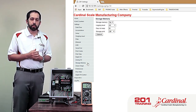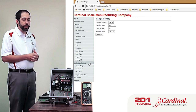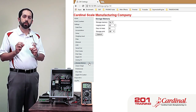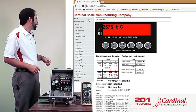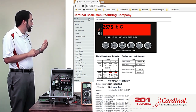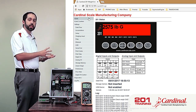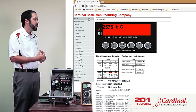The 201 actually has the ability to maintain a log of errors, event count, and event capture. If a micro SD card is installed inside the 201, it will keep a file log of events — like somebody pressed the zero key. That log is also viewable from the home screen, down at the bottom in the log section. The last couple things I did were change the over/under/accept weight ranges, change the setting for the DAC output, and things like that. Somebody can go to this page and see if a scale isn't reading correctly because somebody pressed zero or calibrated the scale when they weren't supposed to.